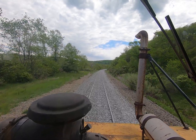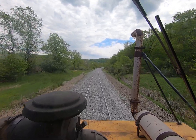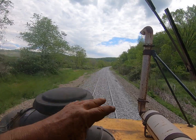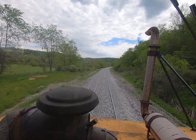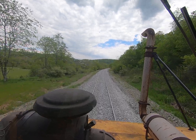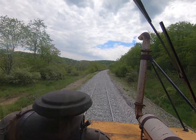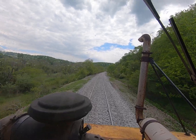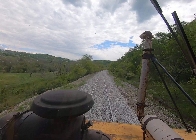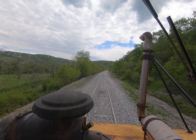That's going to take a while because I've got other bad spots I've got to take care of first. I had some low joints in here. You tamp it once and the train runs over — the train will find the weak spots, so you've got to come back. When you do stuff like this, I usually end up tamping three to five times to get it right. Usually four on average.